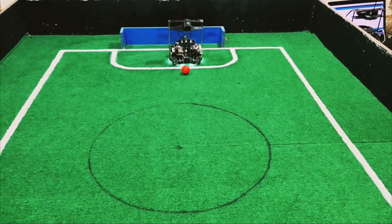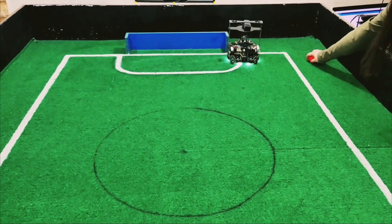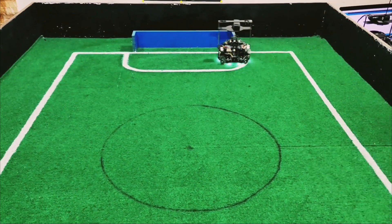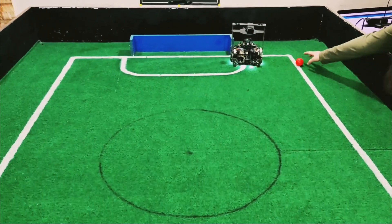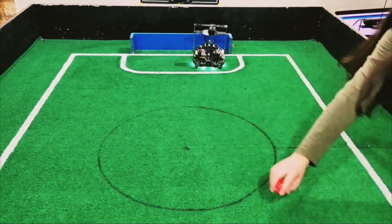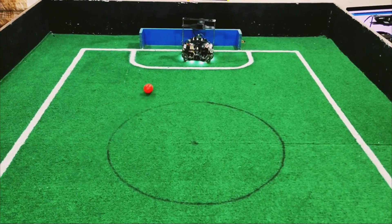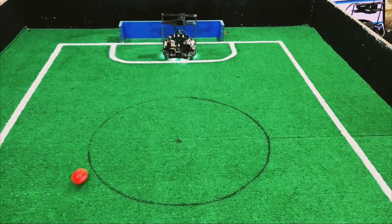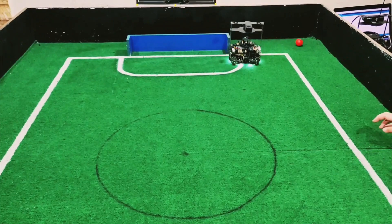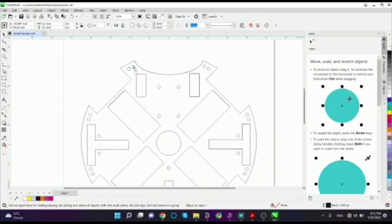For the goalie robot, first we had to specify the range of movement in front of the goal. We used ultrasonic distance sensors to detect this range, but because of the wide viewing angle of this sensor, the robot had mistakes detecting the wall and goal range. So now we use sharp distance sensors to detect the range of the goal. When the ball is not in the robot's range of vision, to make the robot ready to defend quickly, the robot moves itself to the middle of the goal.